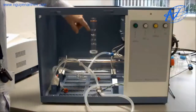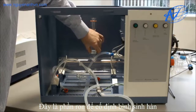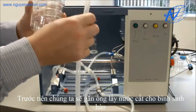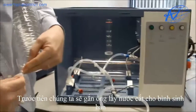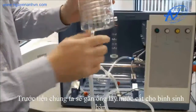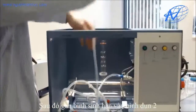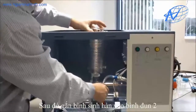The next thing to do is to check the o-ring seal and the stabilising seal on the rear boiler itself. Make sure they're intact and fitted properly. We will then fit the rear condenser. To do this, we attach the 8mm 1m tubing to the drain outlet of the condenser, and that is tie wrapped. To fit it, we go from the top — it then fits on top of the boiler vapor tube itself.